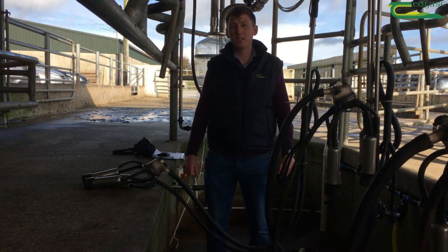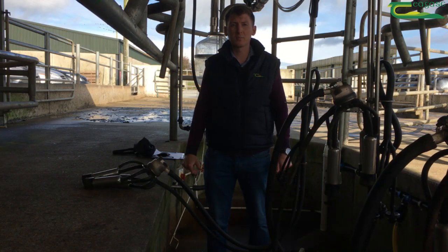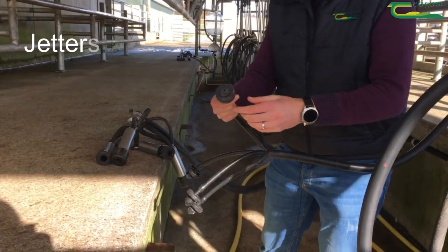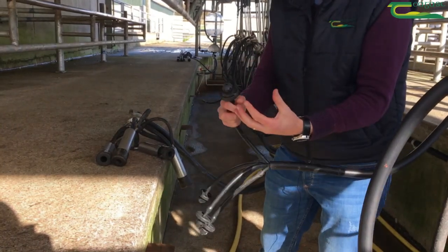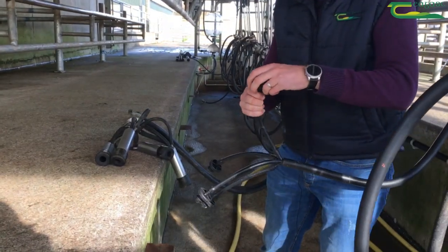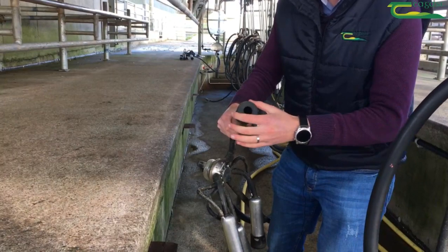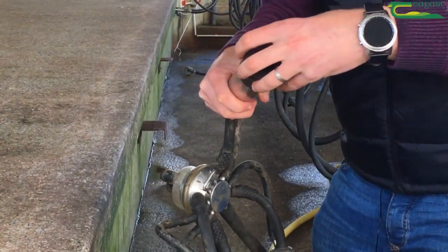What I'm going to look at is a couple of things in the cluster, around the cluster unit, in the milk parlour itself, and the thermodurics and sources of contamination. The first thing is the jetters - just looking around, are they actually clean? You can see in this parlour that they are very, very clean. Sometimes in the tray you can see the outside ring where the cluster would sit, and check for any dirt within that tray itself, particularly with the caps or hoods over them where you can build up dirt. At the bottom of the cups you'll see the dirt - these are relatively clean, but that's an area to go after because that is getting directly into the milk line.